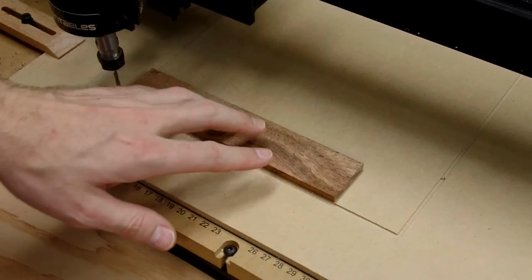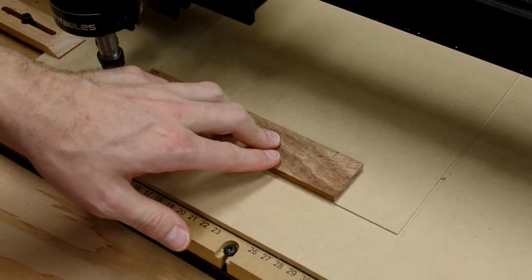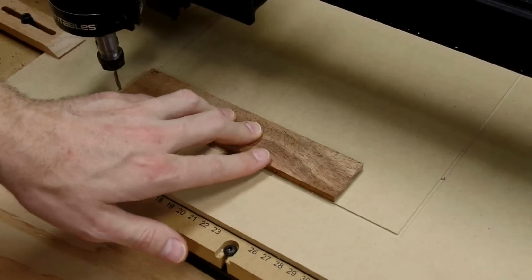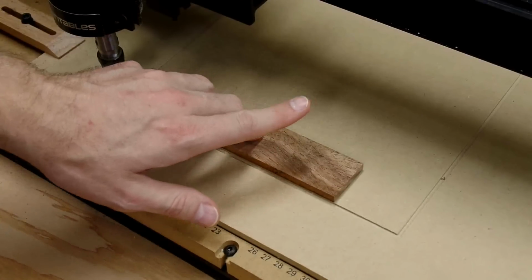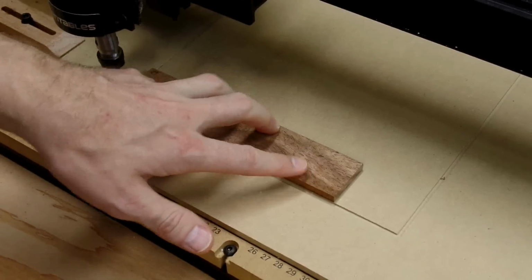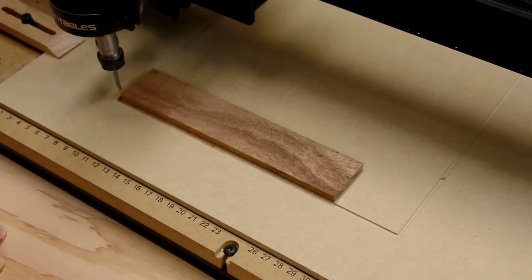We're not carving all the way through. Then we'll be able to install the electronics, glue this to the other piece, and turn it back into one thing where all the LED lights will just be inside. They'll be able to shine up through the hole that we made in the other piece and light the sign. So this one will be a pretty quick carve. Still a 1/8 inch bit, but it's not going very deep, just deep enough for the electronics.